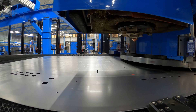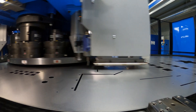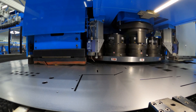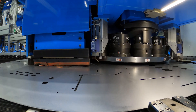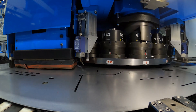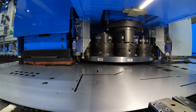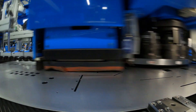That's a great foundation to then build on with a laser head. Attached to the main frame of the machine is a laser head. The sheet is still moving around as it does under the turret punch, but the laser head is able to cut long runs, do complex geometries, and do things that would require lots and lots of special tools for different forms and features.